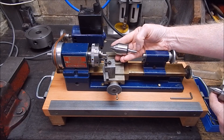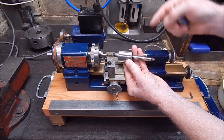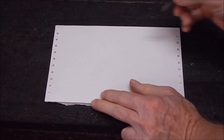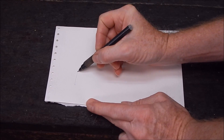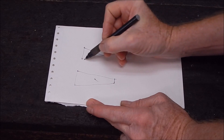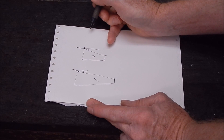You could do that on a conventional lathe if there's enough travel on the topslide, no problem. If you're going that length, you definitely need a toolmaker's lathe to cut a taper of that length. So what's involved? Well, basically not a lot, because Morse tapers are all virtually the same angle. A Morse 1 and a Morse 0 will have the same angle as each other.